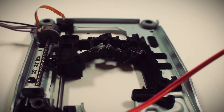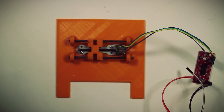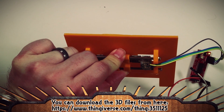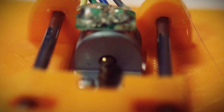The problem with these drives is that they're not meant to hold extra weight — the moment you have too much weight, the motor stalls. So after a lot of sketching, designing, and trial and error, this seems to be the design that works best: the motor sits in the middle and just guides the tray, while the two metal rails take the bulk of the weight. This is basically the x-axis, and the idea from here is to do something similar for the y and z axes. The nice thing about custom parts is that I can customize them for any extension I want to use.